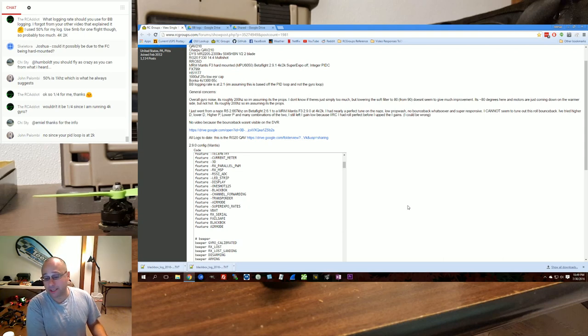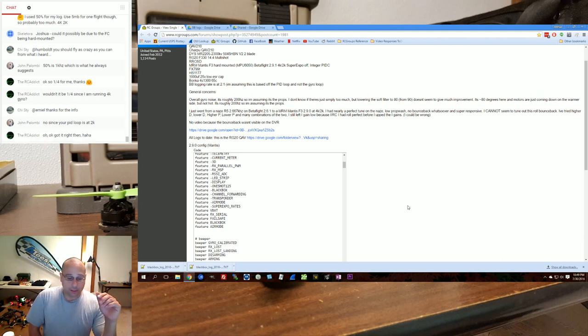I'm suspicious that a motor with a built-in ESC has a mediocre ESC. Until proven otherwise, I'm going to assume that the manufacturer is not selling for performance, but is selling for convenience because it's an all-in-one product. So if that's true, then with this motor with built-in ESC, I would want to know that the ESC was good. But then also, if you smoke the ESC, now the motor's no good. If you smoke the motor, the ESC is no good.